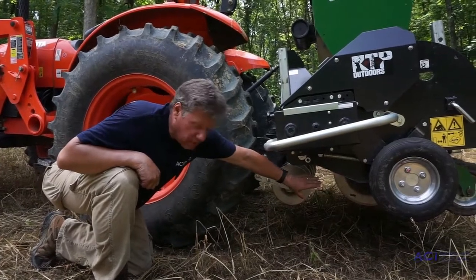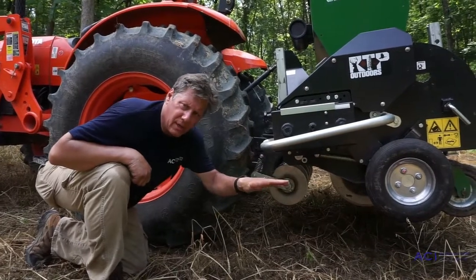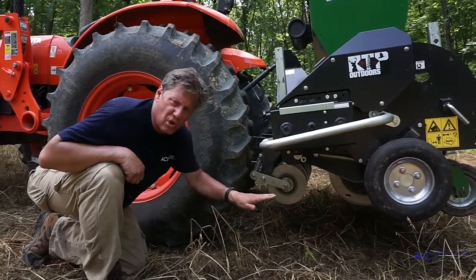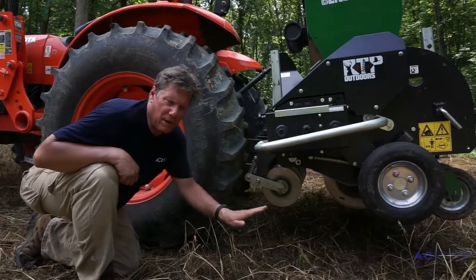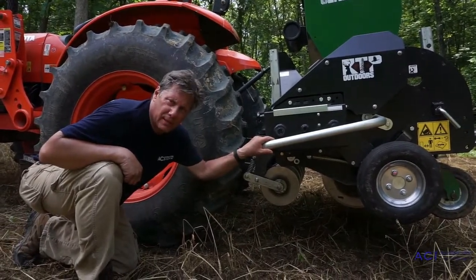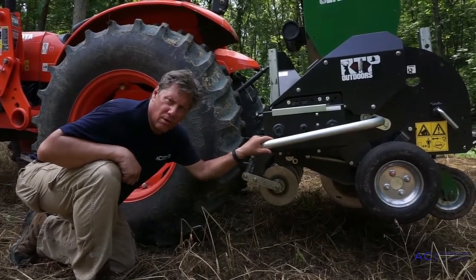If you're going to go at high speeds with this machine, your coulters and disc cutters are not going to get a chance to reach the depth they want — they're going to tend to ride up on the ground. So your depth settings are going to be inaccurate, and it's just hard on the machine. We've spent a lot of money on seed, on the machine, on our fields and property. Let's just slow down, take the proper amount of time, and get the seed in the ground the way we need to without being too hard on our equipment.